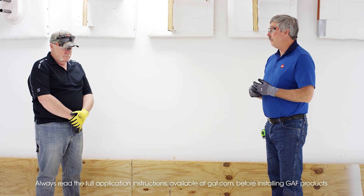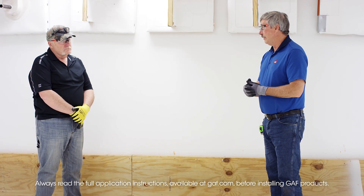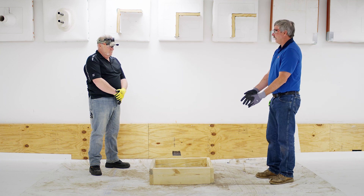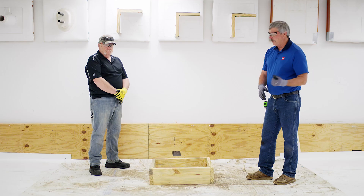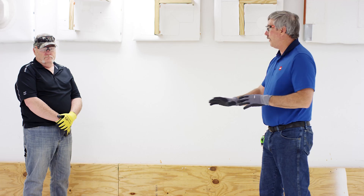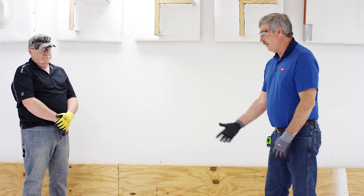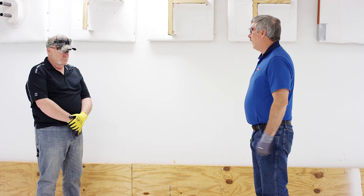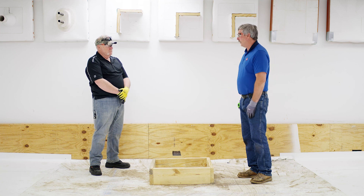In some instances, you might be able to mitigate some cleaning, and this is one scenario. There'll be all kinds of scenarios you run into like this. This could be an existing vent — maybe the building owner is going to install a new one or put a new hood on. In this case, let's say the building owner is adding a new curb. The ductwork is still in here, so you come up and you've got to flash it.